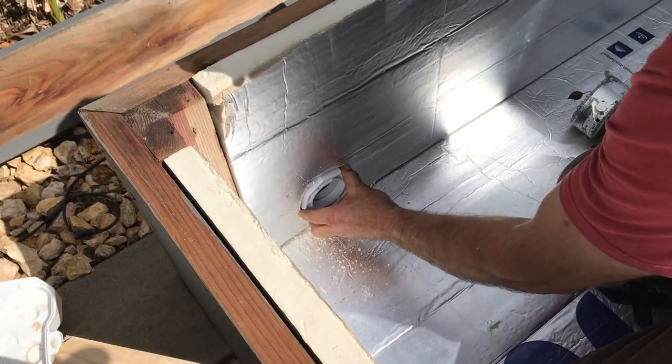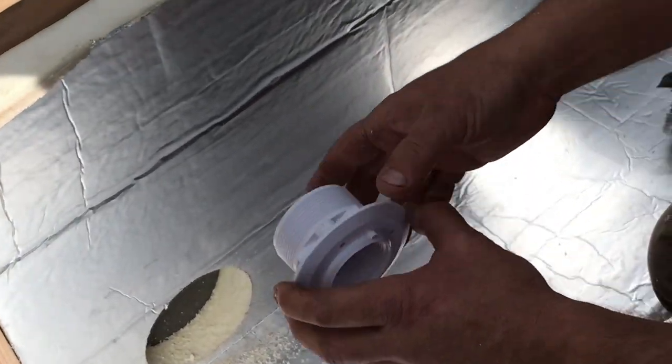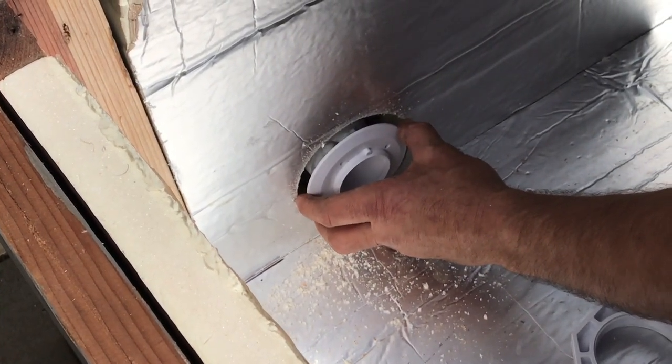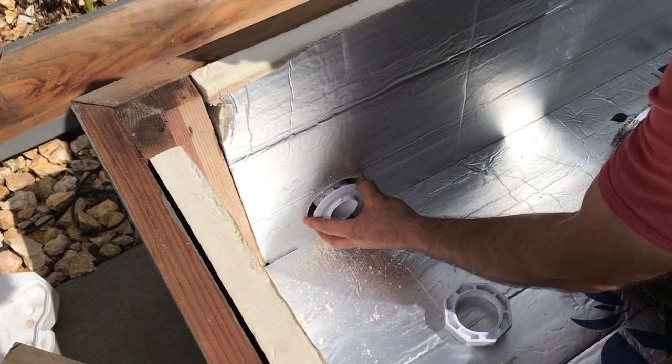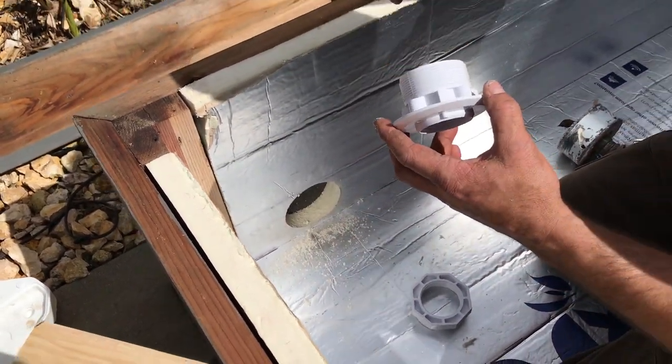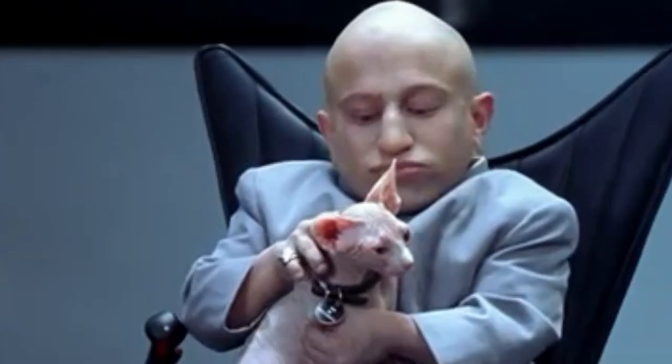Now the nut will fit in the insulation. I'm going to drill a hole right through the center with a small drill bit to pilot it, make a small hole just big enough for a fitting to screw through so I don't take too much material out. That's going to go straight in, and then I'll come through the back with a piece of PVC and screw it right in - I'll be able to run my plumbing along the back. That's why Dennis is here; he's the brains behind this operation. I'm just his sidekick, handing him tools.